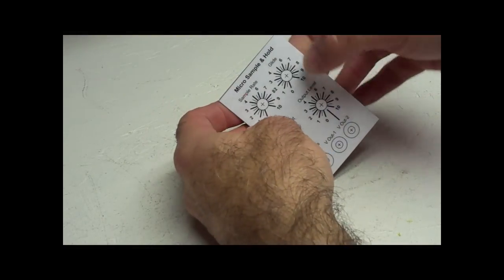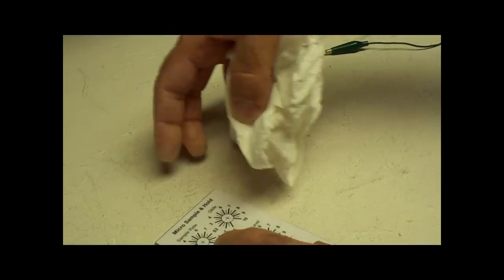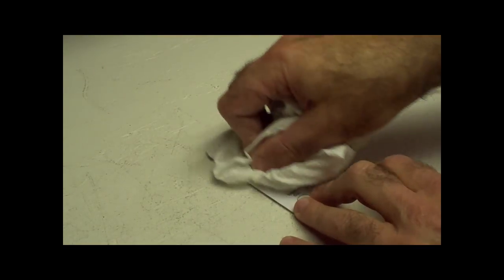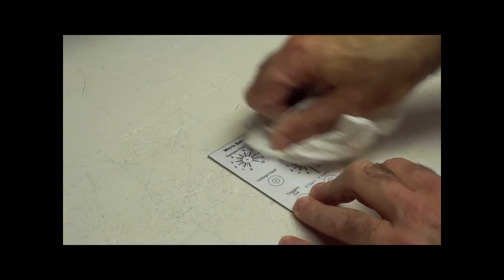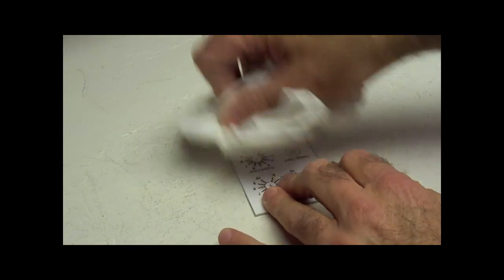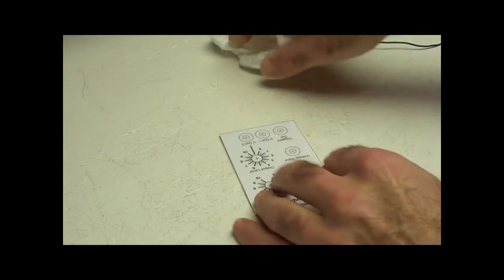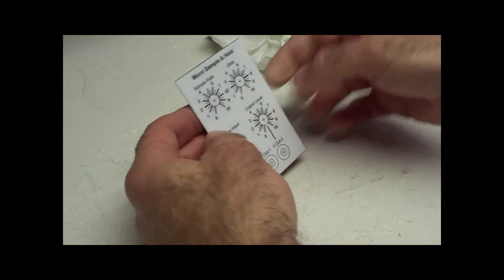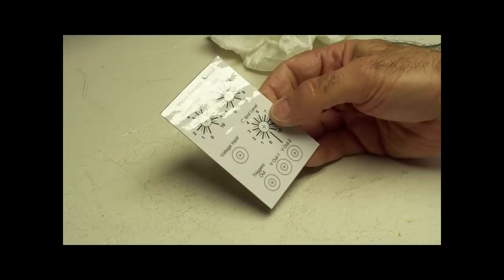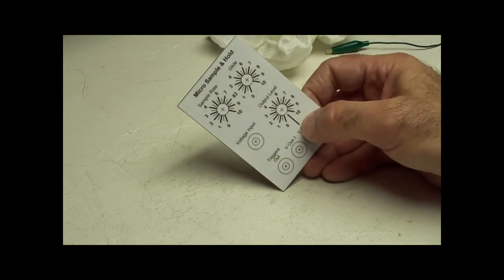So I'm going to hold it up to the light and make sure my holes are lined up. Alright, that came out really well, actually. Now what I'm going to do is burnish this a little bit — I'm just going to use a paper towel. What this does is spread the glue around and get down in there, giving you a good seal between the metal and the template. The nice thing about the laminated front is that it's nice and smooth when you're burnishing it. So now I'm going to let this dry for a while, and then I'm just going to take an X-Acto knife and cut these holes out.